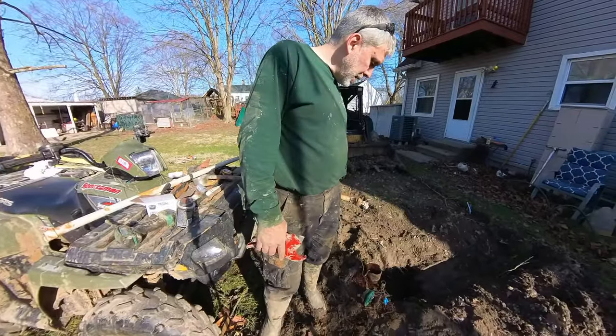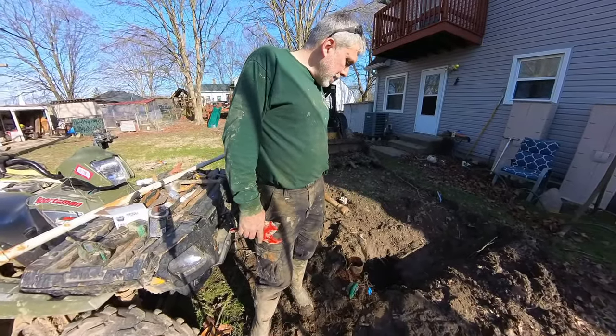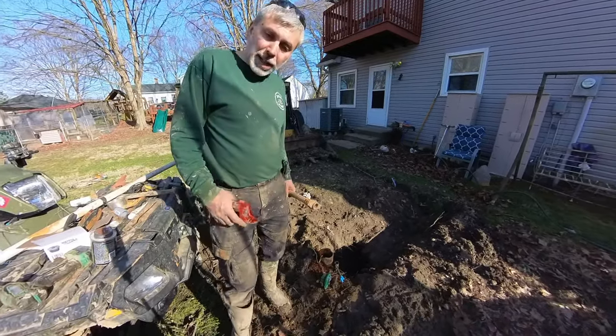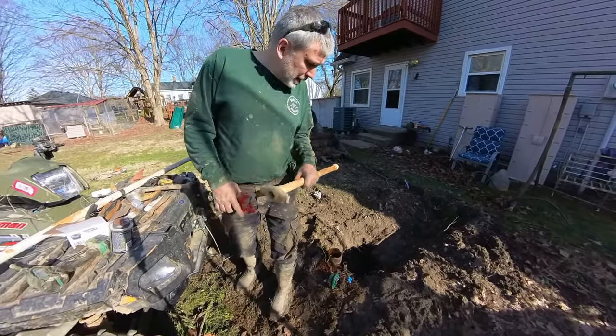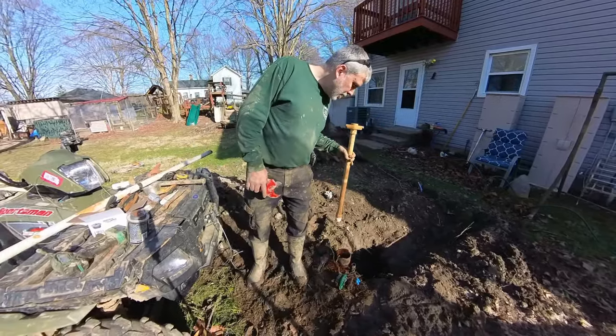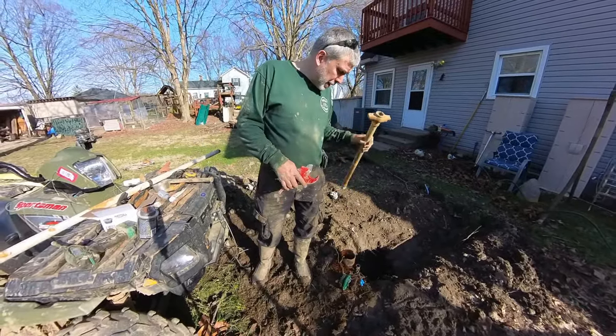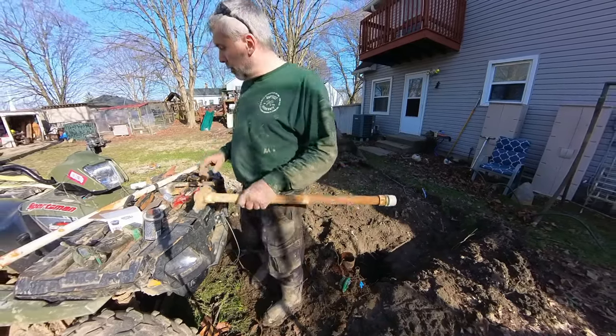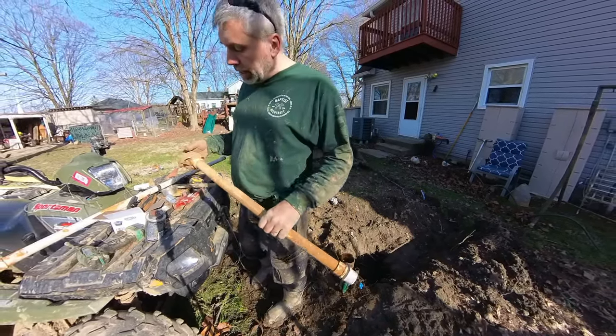All right, everything checks out. And so, I'm going to go ahead and get ready to put that cap down and put this fitting in here, this pipe. Basically what this will do is keep that hole clean, so whenever we go to pull the pump next time, it'll be clean. And it's actually going to stick up through that. Because this is now not long enough, 29 inches is what we need. This is like 28.